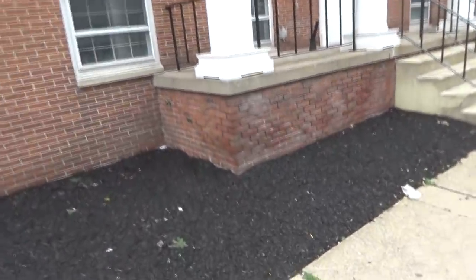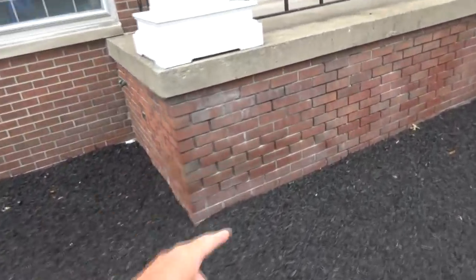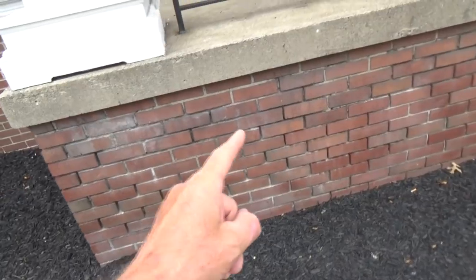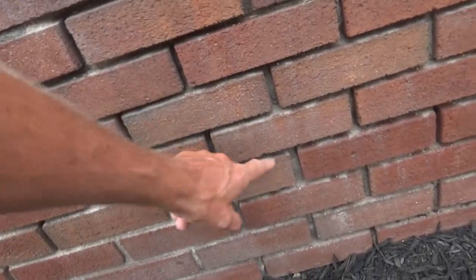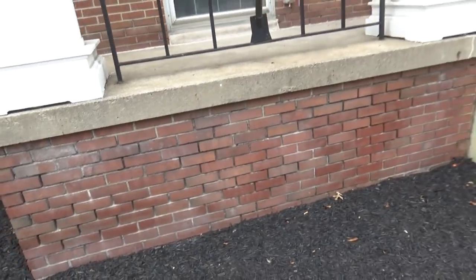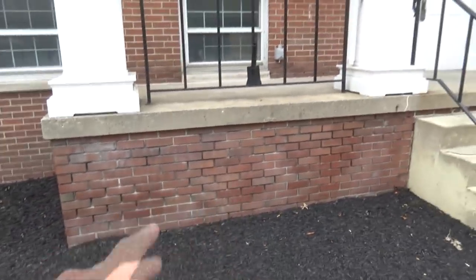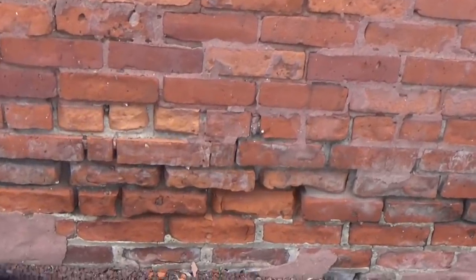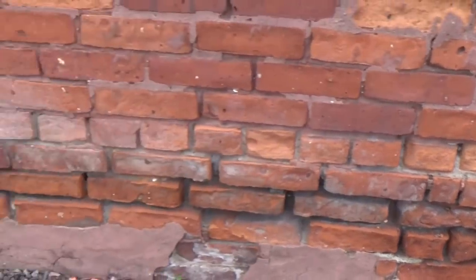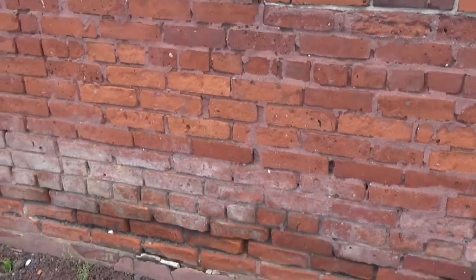We're looking at a modern building — when you don't have a damp course and don't have granite or something, and they probably used regular mortar or lime, that's what happens. All the lime falls out because of our weather. Here is an example of what happens to brick when there's no water table. This is a modern building — you've got to keep patching. Here's why you use the water table: if you don't have one, all the cement joints will be falling out and you've got to keep fixing them.